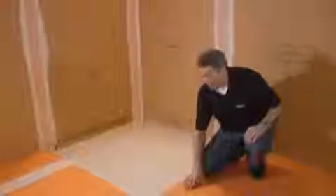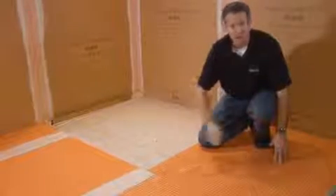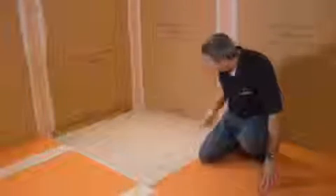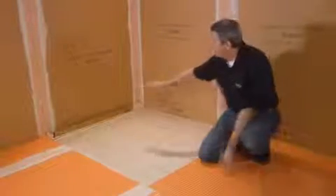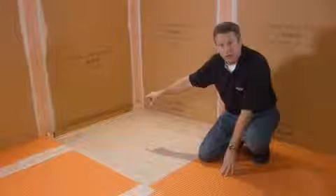We've established a height on our bathroom floor so we're now flush with the top of our tray. We've also installed DITRA, our uncoupling membrane, and tied the seams together with KERDI bands, so now we have a waterproof bathroom floor. We need to complete the waterproofing by tying the floor-to-wall connection all the way around the perimeter of the tray, and connecting the drain body to the back wall and to the tray using the KERDI that's already on the body.